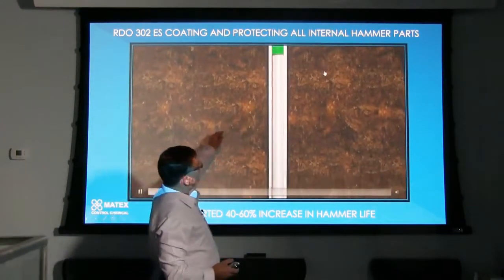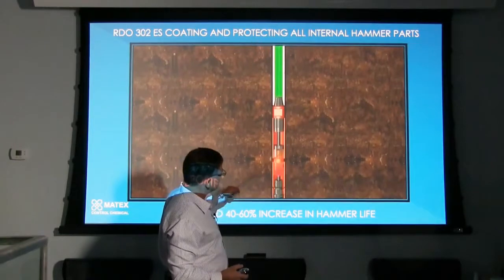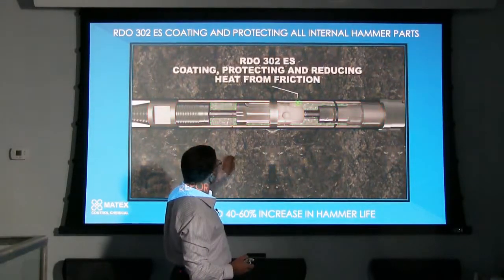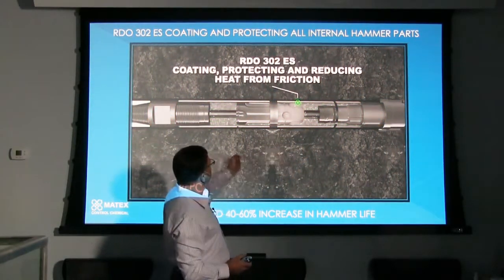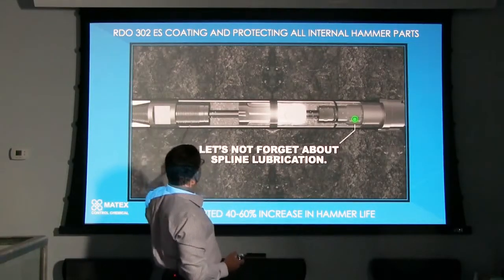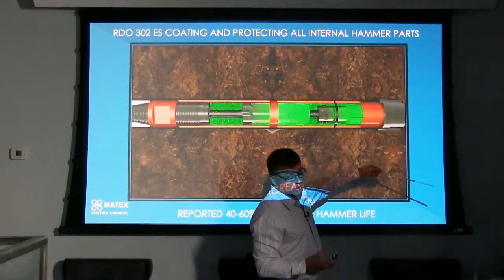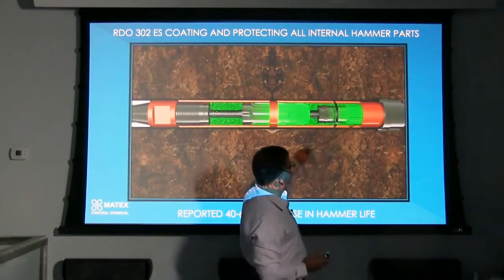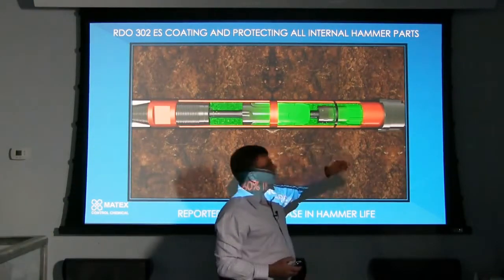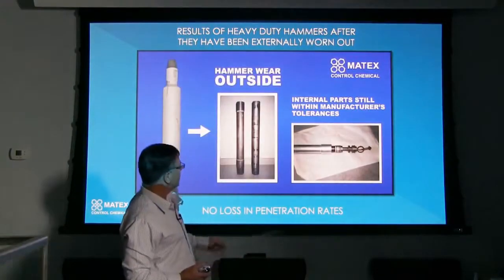Here we're showing where the lubricant is being injected — shown in green because it's environmentally safe. The point we want to get to is you can see your piston going up and down in your case there. The friction being built between the OD of the piston and the ID of the case — that tolerance is very, very slim, very thin. If we can keep a good lubricant in there and keep that piston cooled and lubricated, we're going to continue to maintain the back pressure in this hammer, which puts energy to the bit, consistently drives your bit into the formation, and continues to maintain your penetration rates. Also, we've heard from numerous customers that their chucks are not wearing out nearly as much because of the lubricant being put on the splines, the chucks, and the bits themselves.